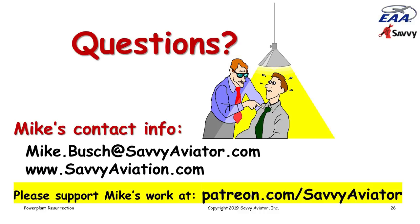And Malcolm's wondering, what are your thoughts on leaving a Tanis heater plugged in 24/7 during the colder months? Okay, that's a question that has come up a number of times in a number of these webinars. Tanis did a white paper on that subject some years ago where they did some testing. And their recommendation was that if the engine is purged of moisture by hooking it up to an engine dehydrator, which is just a little air pump that pumps pre-dried air into the crankcase all the time, then it's fine to leave the heater on 24/7.